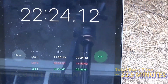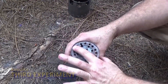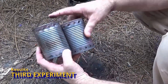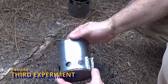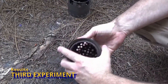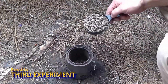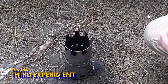Here you can see the stats of this last experiment. The overall burn time reduced slightly to about 22.5 minutes, which is still very good for one cup of wood pellets. Those openings in the pot stand added considerably to the swirling vortex — that looks really nice. For the final experiment I did yesterday, which I recorded again today, I noticed the primary air holes on the outside of the can were lined up with the fresh air inlets, and I have a feeling that's what's causing the pulsing of the flames. So I made a new inner can with no holes around the outside but the exact same number of primary and secondary air holes.